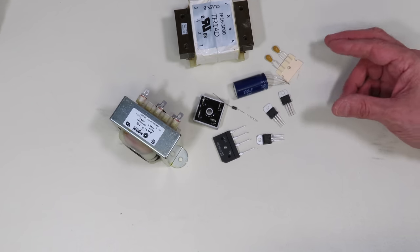A very common configuration is the full-wave rectifier, which can be wired in different ways. The bridge rectifier consists of four diodes, and its output is a series of positive signals with twice as many pulses, as both sides of the AC waveform are included — making it very efficient and the most common type. You can also build a full-wave rectifier using only two diodes and a center-tap transformer, but in that case the transformer output needs to be twice as high as for the bridge rectifier to achieve the same DC output voltage.